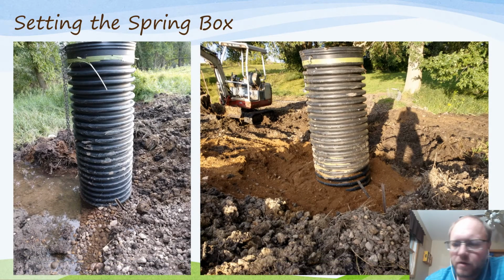So I don't have a lot of good pictures of how I backfill this, because that was a tricky thing to do while you're digging, getting it dug down. But you can see the top of some posts here. I use chicken wire mesh or cattle panels, depending on the size of rocks and gravel, and build a little retaining wall with that to hold the topsoil and the earth back, so you keep digging deeper without everything falling in on you.